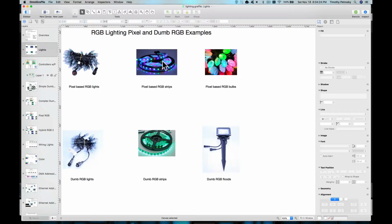You can kind of think of these smart pixels, they actually have little protocol chips. I'm trying to remember the number. It's WS2811 or 2911, I can't remember the number exactly. It's later in my notes. But these don't. These actually use voltage in 4 wires. These use 3 wires where one of them is a data channel. We'll show you that as well.